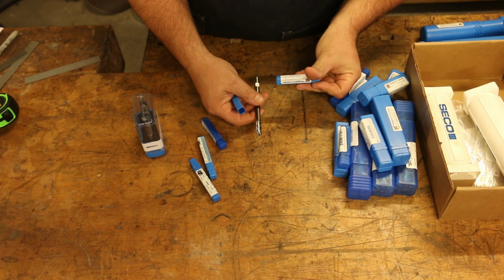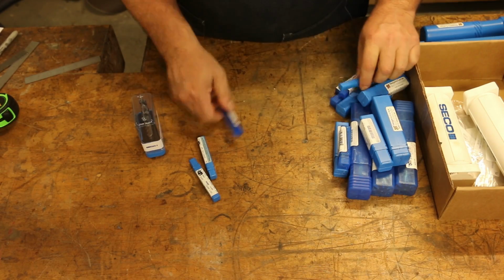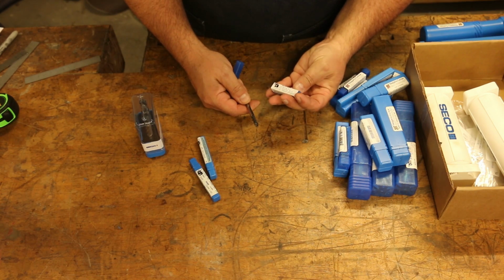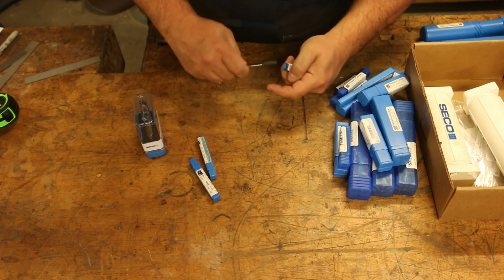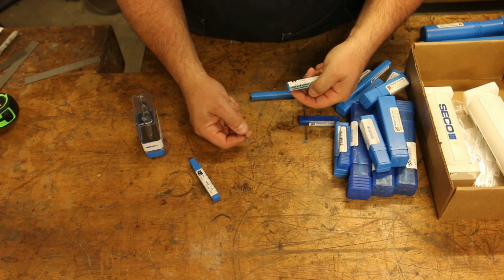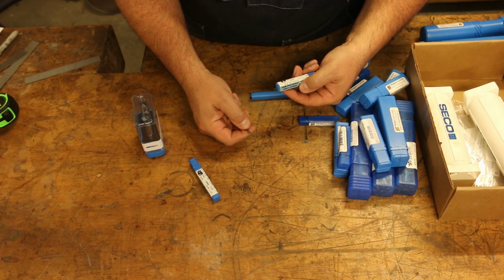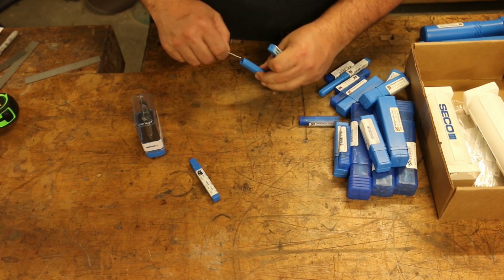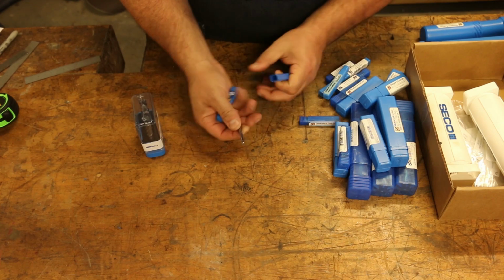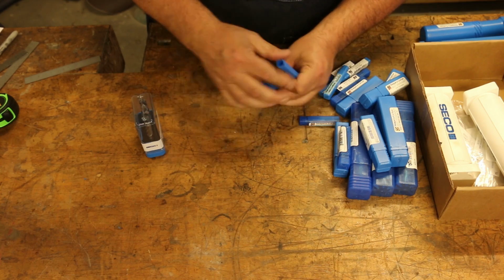End mill ream, R-E-M. I don't know, that's interesting. I'll have to find out from Dennis what that was meant for. Another 5 Flute, carbide end mill here. Look at this little special dude here. So that one, 5/64 diameter, 1/8 inch shank. That 4 Flute, carbide. So that's another specialized cutter there. Little 2 Flute ball end mill. That's solid carbide, 5 millimeter.